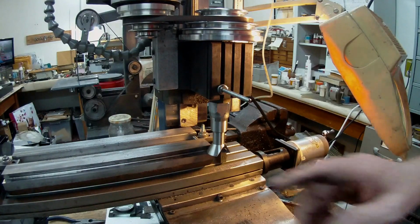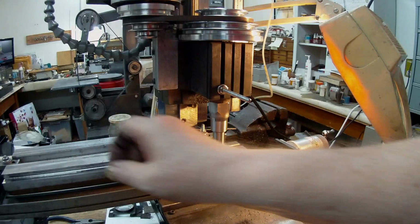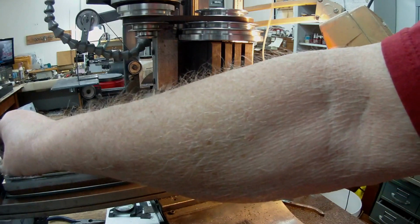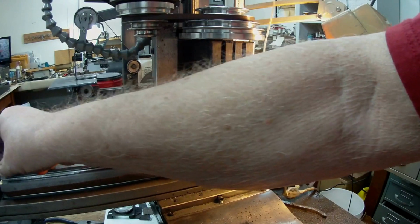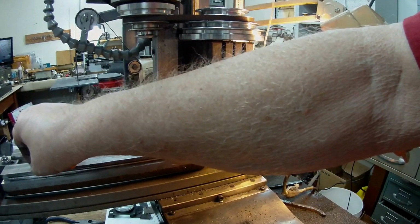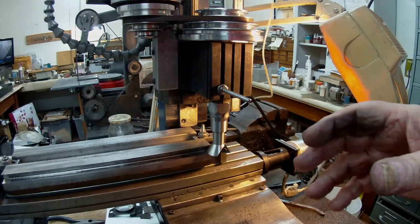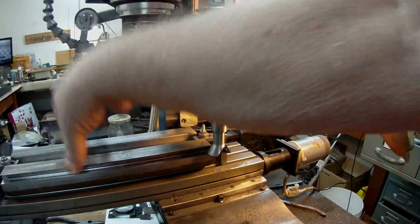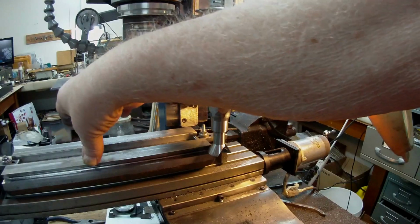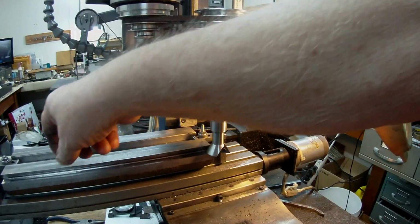So once I've done the dovetail and got that completed, I'll put an end mill up in there and give a lip of about 15-20 thou along that front edge to get away from the sharp edge, for when you're mating this edge with the piece that goes on top with the dovetail. You don't want a sharp corner there. You've got to relieve that edge.